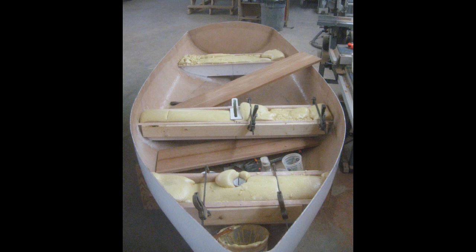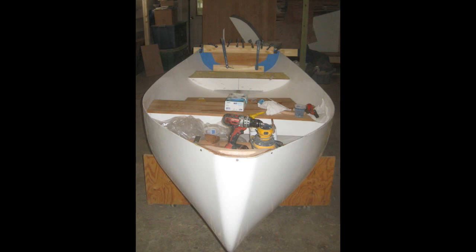The seat tops are about 15 inches wide and are made from edge-glued mahogany planks with splines along the edges. Once I finished glassing the seat bases in, I gel-coated the interior of the hull and then built the mahogany inner transom — again from three planks that are edge-glued and splined together — and epoxied the transom into the hull with a number of large clamps and a bunch of small clamps along the top edge to hold it in place until the epoxy kicked.